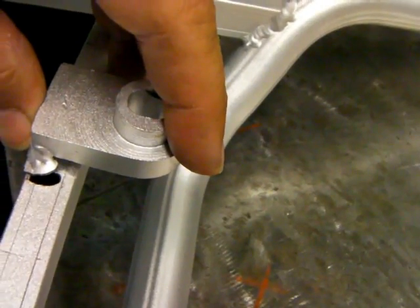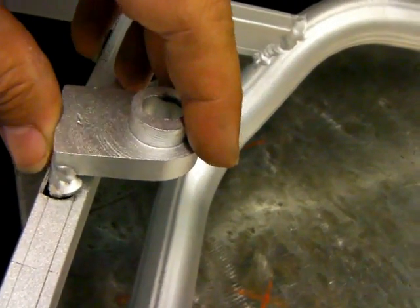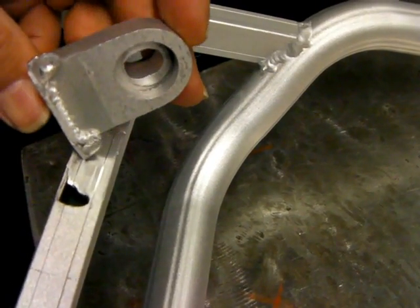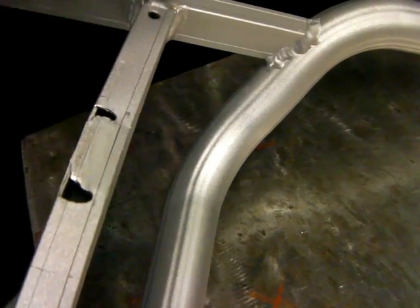The real lesson here is that sometimes you have to leave the fractured surface alone just so you'll have mating surfaces to match up and something will fit after it's welded. I could have attacked it and ground it out, but I would have risked losing the fit. Since I wasn't able to show the actual weld clearly, I'll show some of the how-to training videos I'm working on.